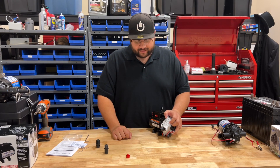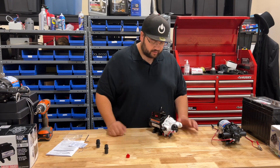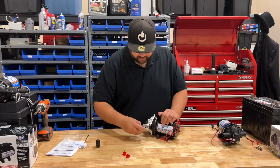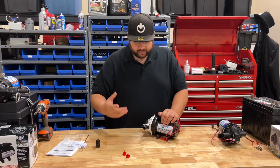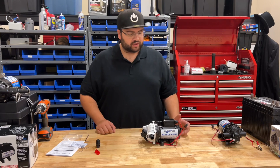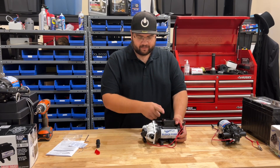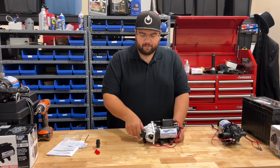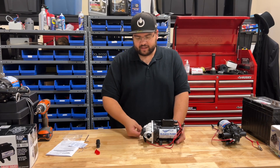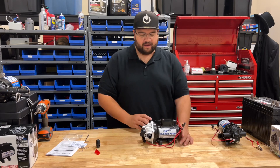You clamp that down and that's how you install your barb. So let's say this pump fails — if you have another one, you just take it out, put another one in, and you're right back in business. Same thing on this side, you've got the little plug there. If this thing were to fail in the field, of course I'd check my fuses first. I probably want to carry extra pump heads with me and an Allen key so I can quickly undo five bolts, take the wires out, put the new head on, quick connect in — and this piece stays pretty much intact. You don't have to remove any of that hardware.